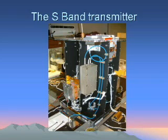The satellite's main radio payload is on 70 centimetres, on 437 megahertz, and it's only 9.6 kilobaud. The data rates that they were proposing were totally inadequate. They were proposing to carry a commercial S-band transmitter. When the particular university involved discovered the cost of space-qualified S-band packages, they effectively withdrew their offer to provide that package, which left the satellite without any S-band.